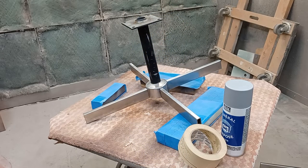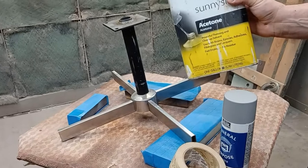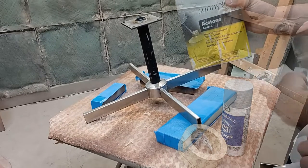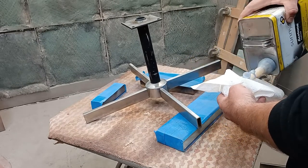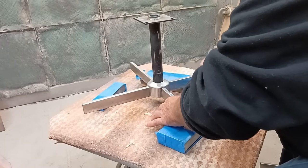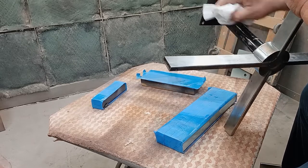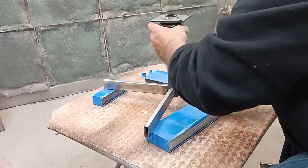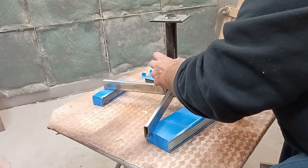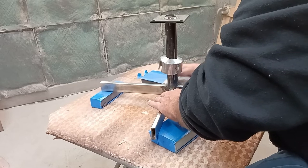Here's our piece. We've already sanded off all of the rust from the chrome. Now we're going to wipe it down with acetone and make sure it's clean. The acetone wipe is very important because if there are any oils, any residue, anything stuck to that old base, then the primer isn't really going to stick well and you may end up having it peel. If the primer peels, the chrome spray is going to peel too. Here I'm wiping it down, and then I'm going to lift this little neck piece and tape it up so I can spray underneath it.